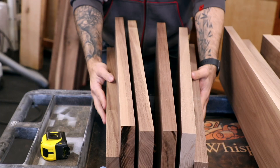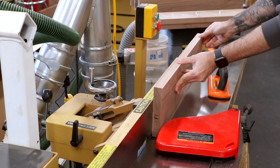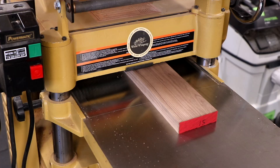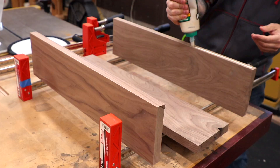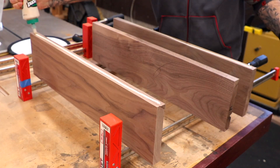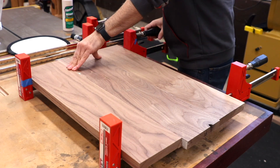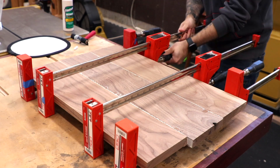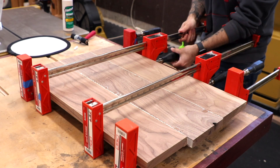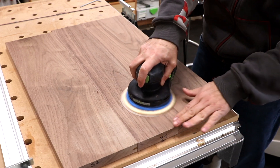Fortunately when we came back the boards were still nice and flat, but I'll give them one more pass on the jointer and then through the planer before gluing up the panels. For walnut I like to use Titebond III — not really because it's waterproof, but because the glue line dries pretty dark and makes for a less noticeable glue line. Once the glue is dry I'll rough sand the panels and put them aside while I work on the top and the bottom.